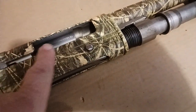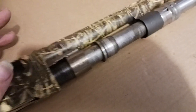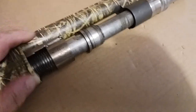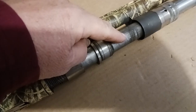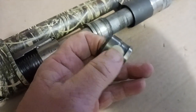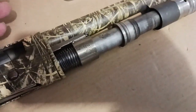What I determined was that these guns are built with fairly precise accuracy. Their dimensions all seem to be within tolerance and very close to each other. However, this lug may be off in its relationship to the magazine by only a few thousandths — five to eight thousandths — which is enough that it caused the piston, even the heavy piston, to not sit properly. It would rub on the side, slow the action down, and in a lot of cases the action wouldn't even work. The gun wouldn't even cycle.